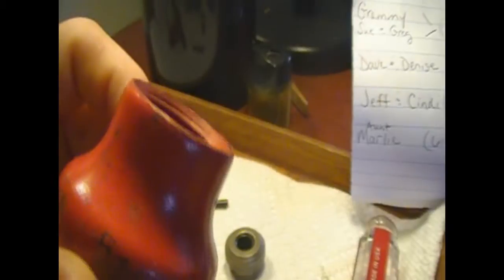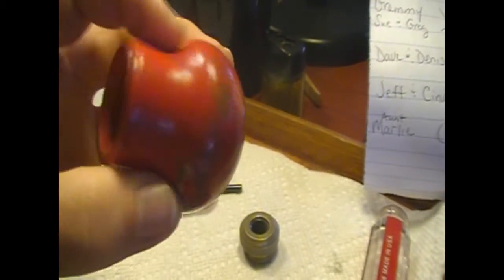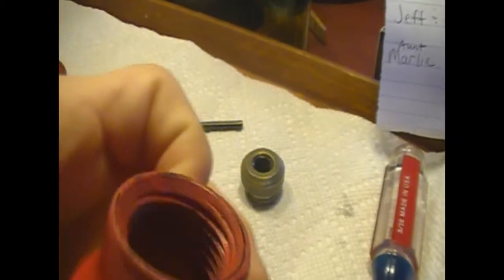The wood handle is made out of hardwood — I chose oak. It is cut to length, bored and tapped with a taper boring at the top, form turned, and then painted red.